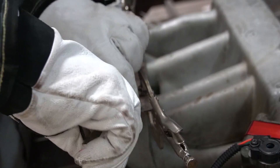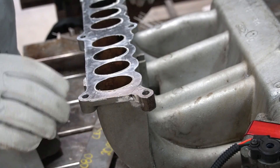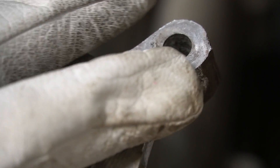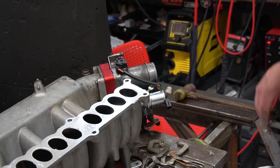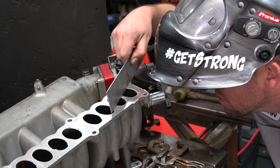I must absolutely check my tack weld. So after I pull that piece off again, make sure it's flat, nice, and even. There's going to be distortion on this no matter what, but as long as it's nice, flat, and even after the tack, we know it's locked into place where it was before — thanks to not grinding that face away. Then we can go after it again.